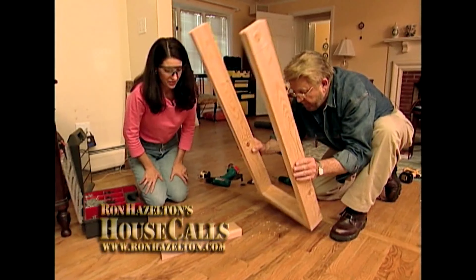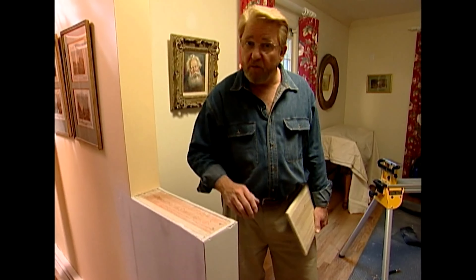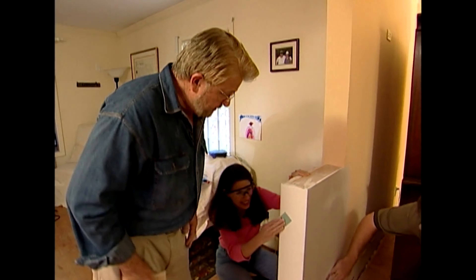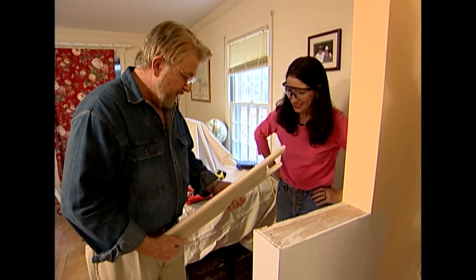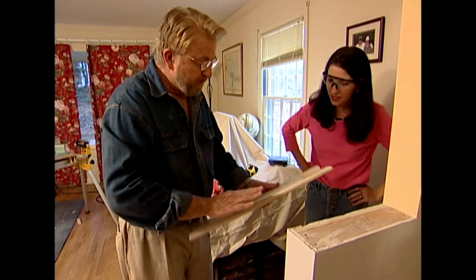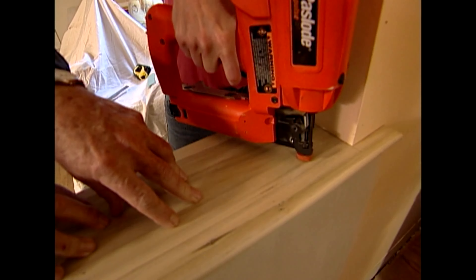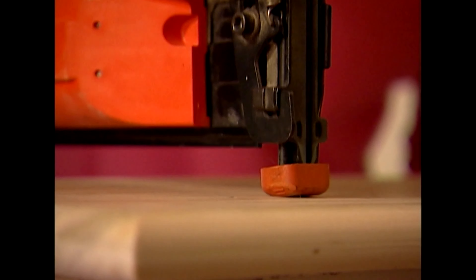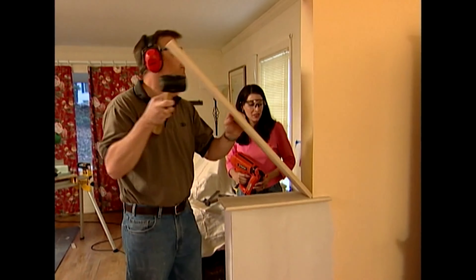Ben and Katherine have two adjoining rooms that are just too big combined — the solution is a knee wall with columns. We've finished the framing and drywall; now it's time for the woodwork. I've been cutting a ledge or shelf out of poplar, with a notch and a little round-over on the edges — it just slips right in on top. We're also trimming out the insides of the openings with jamb material. This kind of woodwork — or millwork — adds interest and detail to just about any room; it can turn a wall from ordinary into elegant.